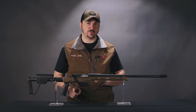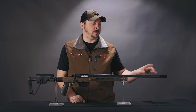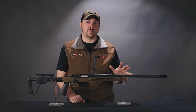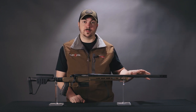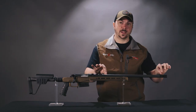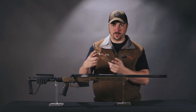I've saved the best part of this rifle for the end, and I'm going to spend a bit of time going through it because it is very different than what you might be used to. The barrel here is carbon fiber wrapped, as you can see, but it is unlike any other carbon fiber barrel we've seen on the market. We're going to break it down — it's a five-layer system with this barrel. Most carbon fiber barrels take a skinny stainless section and just wrap it in carbon like the reel of a fishing line.